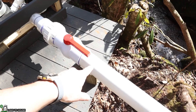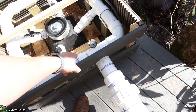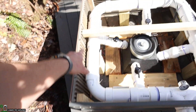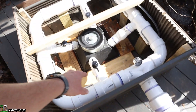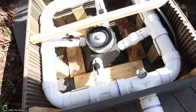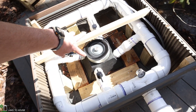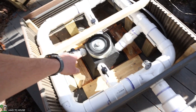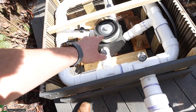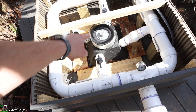The water enters this system through a four-inch pipe and then reduces down to three-inch, but has a T. There is 10 psi here on the gauge. That three-inch pipe skirts all the way around the unit and has T's that sweep in and reduce down to two-inch. There are four nozzles on this system — two of them are 19-millimeter and two of them are 16-millimeter, basically 0.75 and 0.6 inch. That's what hits the Pelton wheel underneath this spinning PMA.